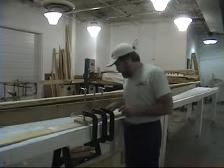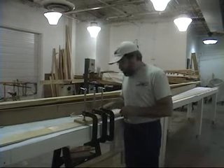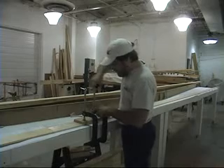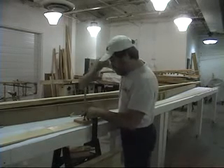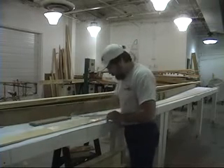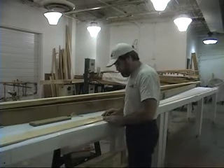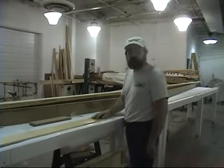In this instance, I just wrote it right here — 10:30 a.m. on Friday — on our piece of blocking. So what we're going to do is just loosen our clamps and clamping pressure, and take our blocking off. And there is our nice new scarf joint. The last thing we're going to do is sand it all smooth on both sides and get it ready for the layup.